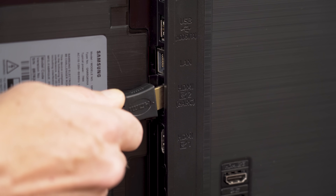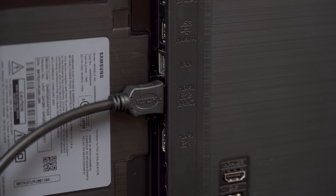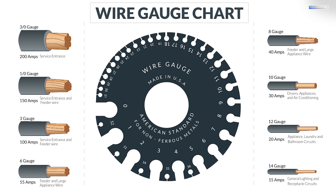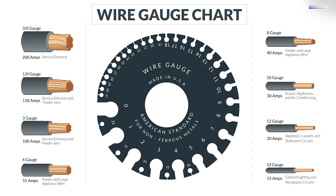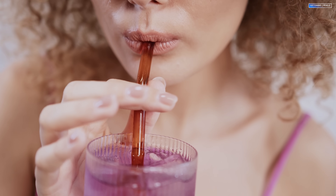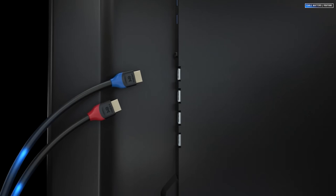In the recent past, my advice for folks looking for guidance on HDMI cables was pretty simple. Your bread and butter HDMI cable at lengths up to about 15 feet were almost guaranteed to work okay. Up to 25 feet, you'd probably be safe, but any longer than that, you'd want to at least look at a lower gauge cable. Keep in mind, the lower the gauge number, the thicker the copper in the cable. The longer your HDMI cable needed to be, the more it would need to resemble a fire hose as opposed to a drinking straw. Outside of that, you wanted good build quality and a solid connector on each end, with bonuses like high flexibility for easier cable management.